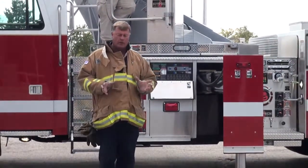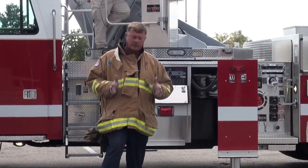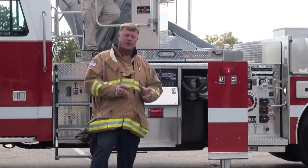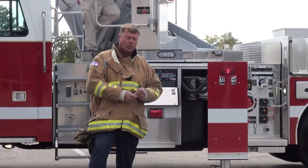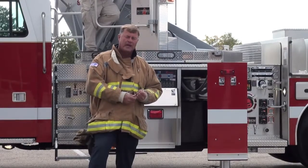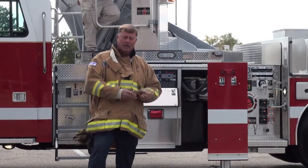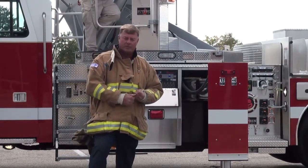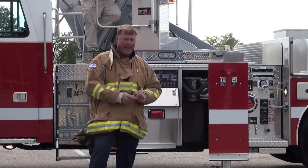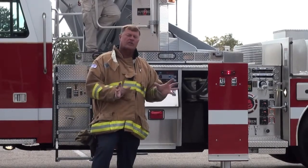And the EPU, all it's doing is operating like a starter motor. It's an electric motor that's generating some hydraulic pressure. I think the big pumps, when it's under normal, is generating like 3,000 pounds pressure, and it flows like 20 gallons per minute. Well, this little EPU unit only generates like 2,000 pounds pressure, and it's only flowing like a gallon or a gallon and a half a minute. So everything is going to be extremely slow.